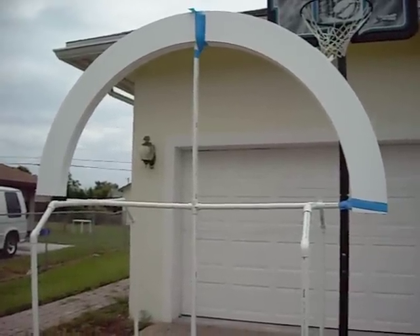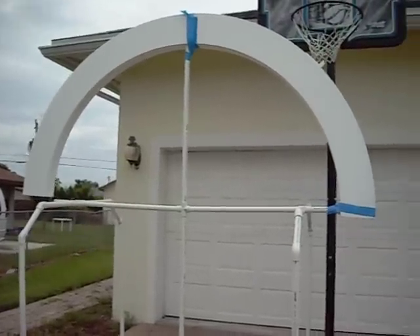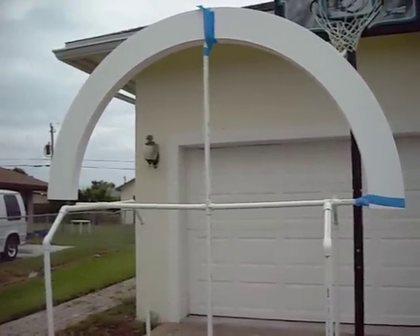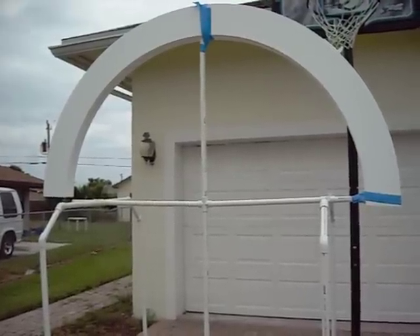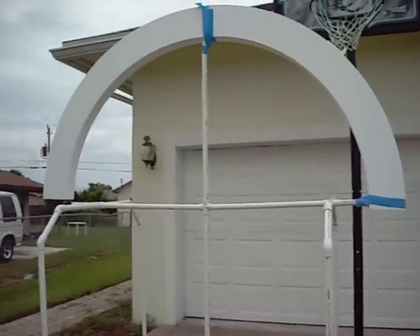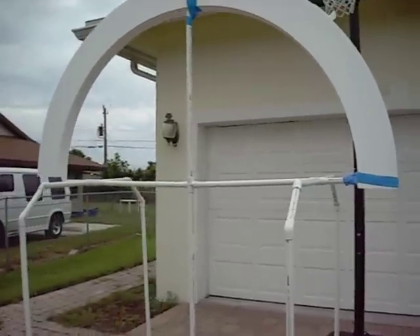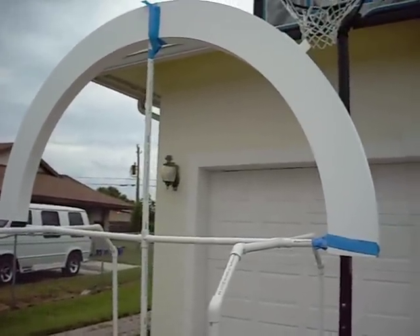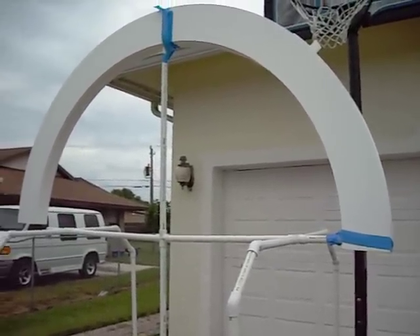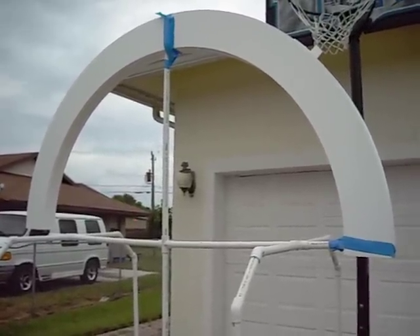I've experienced this before — a tuned loop that is double-tuned, contrawound, wiperless configuration on the main loop is absolutely amazing. You can tune your detector anywhere on the band and tune your main loop, and when the resonating frequencies of primary and secondary align, it just lights up with fantastic volume and sensitivity in the headphones. We'll keep progressing as time allows — I hope you enjoy watching this come together and eventually get on the air. Catch you guys later!